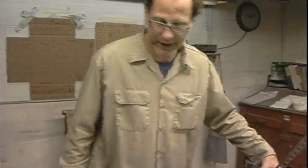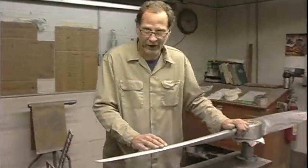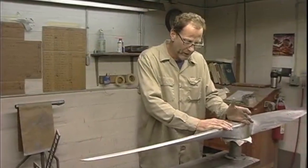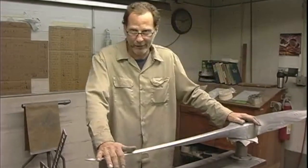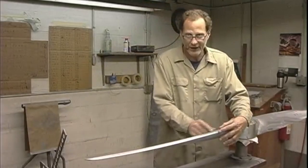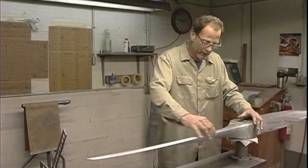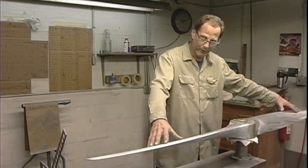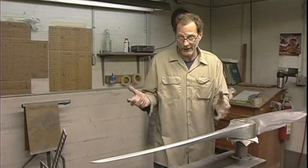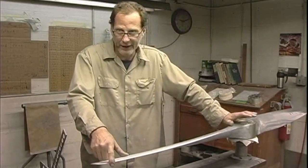When they make a prop, when they get it approved by the FAA to be a product, they have what they call station lines, and that's from zero station, which is dead center. The engineers come up with a plan, and they'll get a prototype, and they epoxy sensors on the station lines all the way down, and the wires are all epoxied onto the prop on both blades. Then the pilot flies a plane, and an engineer sits there with a laptop, nowadays, and records how much vibration is happening throughout the length of the blades. And there's a criteria that they have for that.